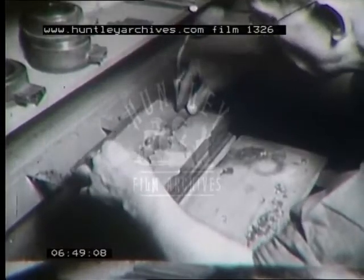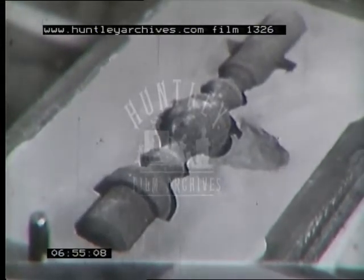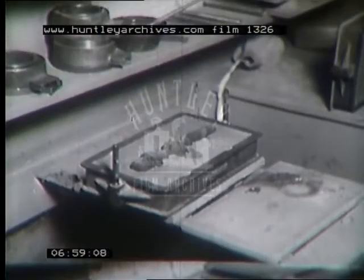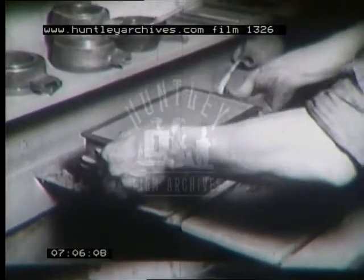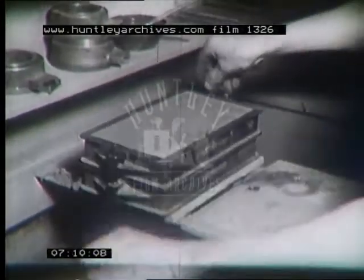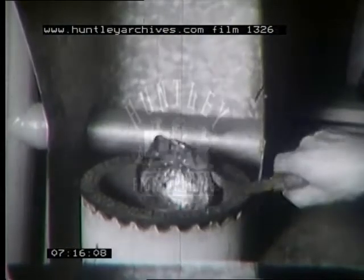This core corresponds to the inside dimensions of the candlestick. It is made of sand baked with oil or molasses. The space to be filled with molten pewter can be seen about the edges. Extensions hold the core proper in place. The form is now carefully put together with the entrance gate for the metal uppermost, then firmly locked with pins at either end. It's ready for the pouring.